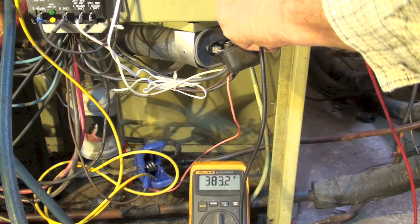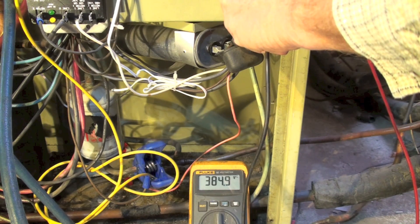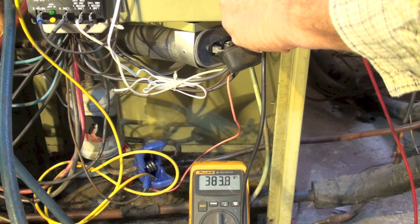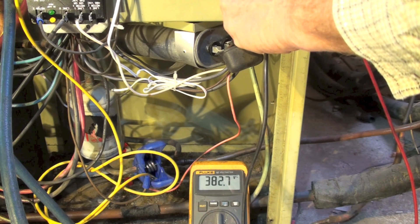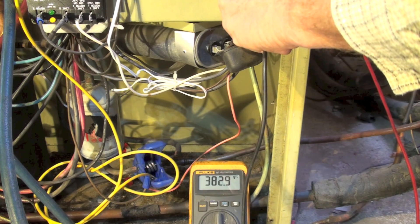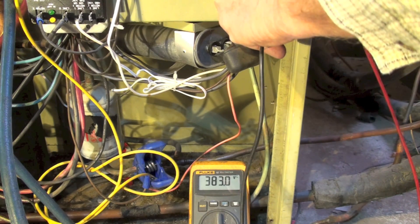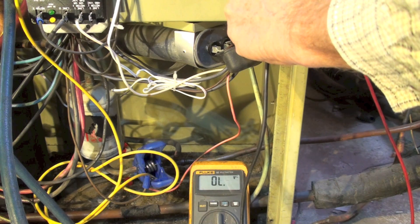We're running about 385 volts. That is in excess of what the 370-volt insulation is rated for. So that's what the two different ratings are about. The 370 can be used on 120 volts but not 240, and the 440 can be used on 220 or 120. That high voltage reading is exactly why the higher rating exists. That's it on comparing capacitor voltages.